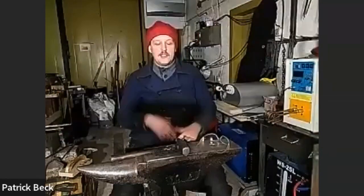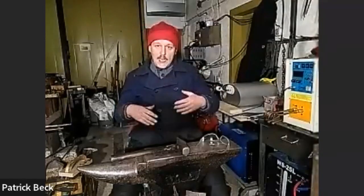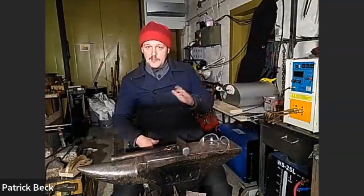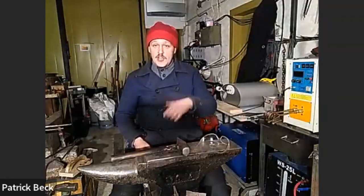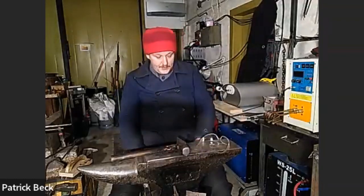I thought that was quite a lot - is there another way around it? Around that time, Emil talked about induction forging, and I decided to give it a try. It cost me about 1000 euros for the machine and cooler at that time - prices have risen since. Worst case, I'd have wasted 1000 euros instead of 5000 plus coal, which is now around 1500 euros per ton shipped to the workshop.